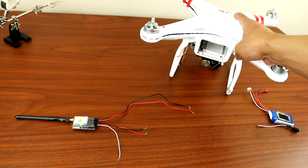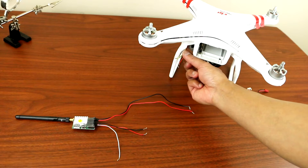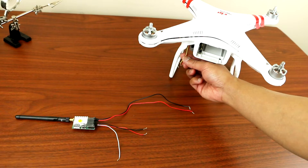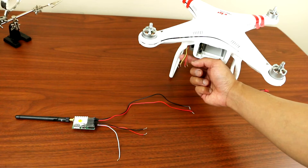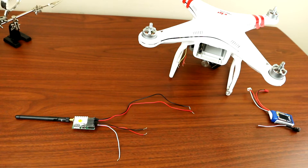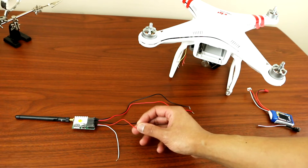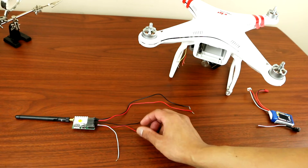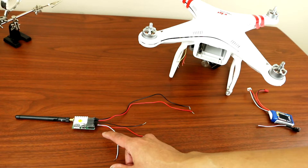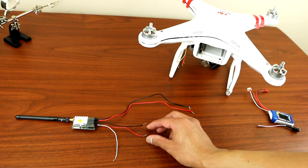To eliminate the battery and USB, what you want to do is attach this to the wires — those three or four wires that are on the side of the landing gear. You'll be soldering those wires to this transmitter, so you have to be careful when you solder, especially where the video output is. Sometimes it comes with three wires.